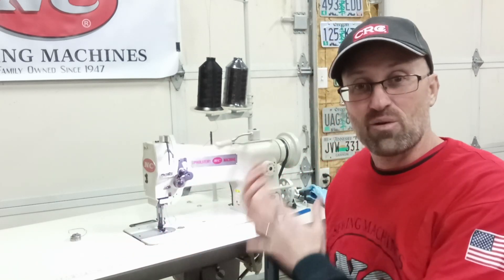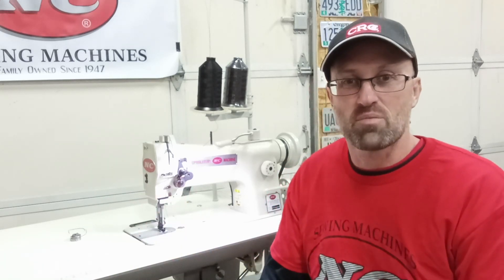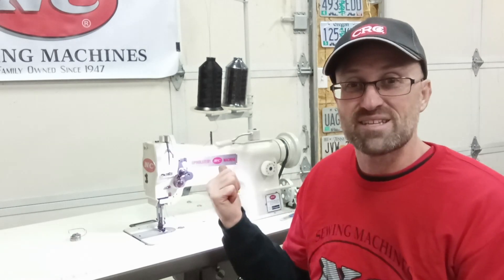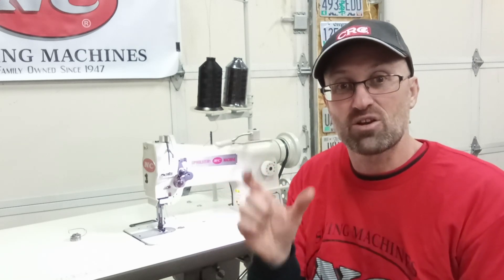Hopefully that answers your questions on how to do it. You can swap pulleys, but first make sure your machine basics aren't fighting you — take care of those first, then swap the pulley if needed. For probably less than 20 to 30 dollars shipped, including a belt swap, you can have the machine feeling like the machine of your dreams. If you have questions or comments, leave them below. I'll look on Amazon for extra pulley links. Just remember you have to size them based on the shaft collar diameter plus the pulley diameter, and double-check the belt before hitting buy. We'll see you next time.